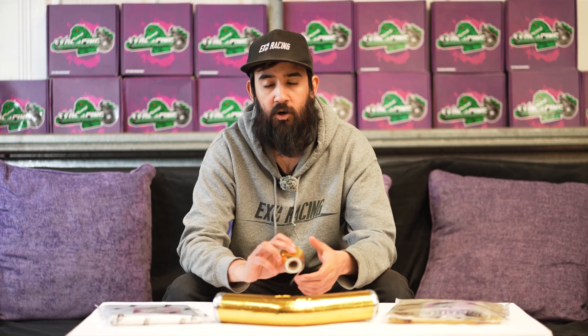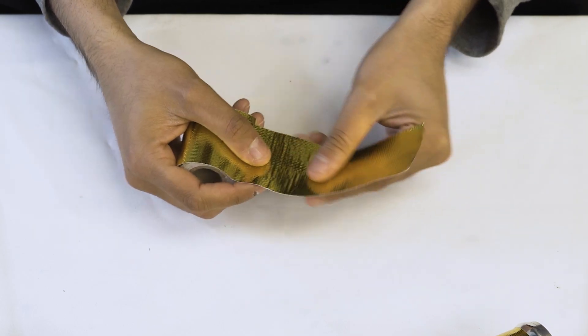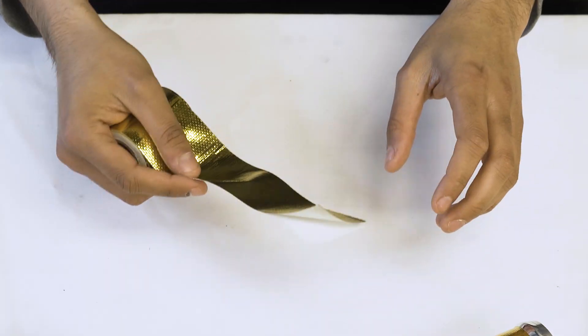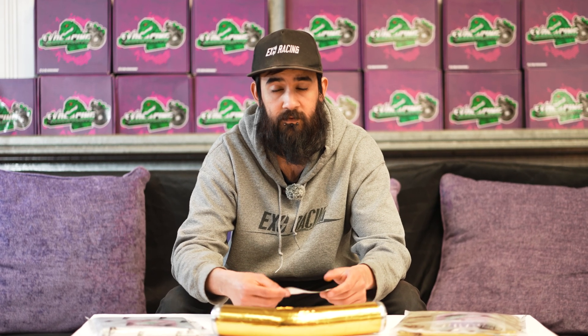The top layer is normally a metallic film laminated over the top — it's the same for gold and silver, although gold can generally reflect a little bit more heat, about 90%, whereas silver does about 80%. Most reflective tapes have a fiberglass or glass cloth backing to reinforce the tape and make it way more durable. This extra strength helps it stay in place, conforms around everything correctly, and is great for really harsh environments.